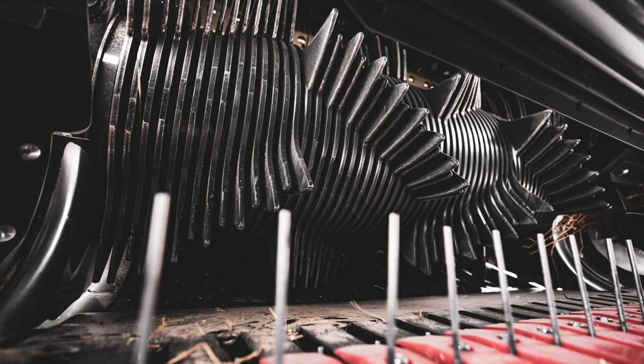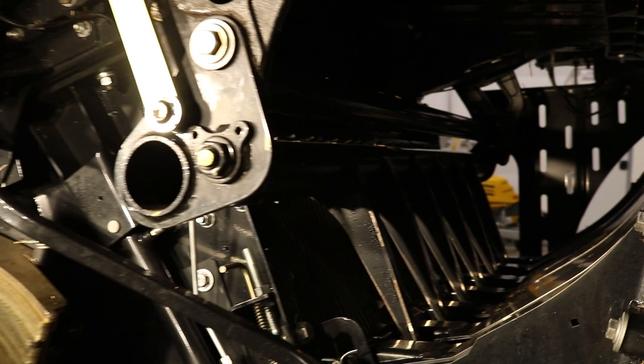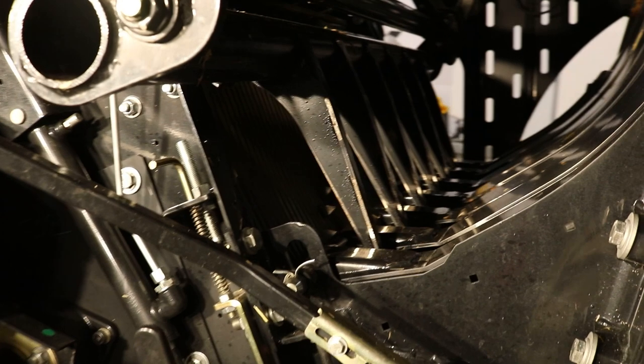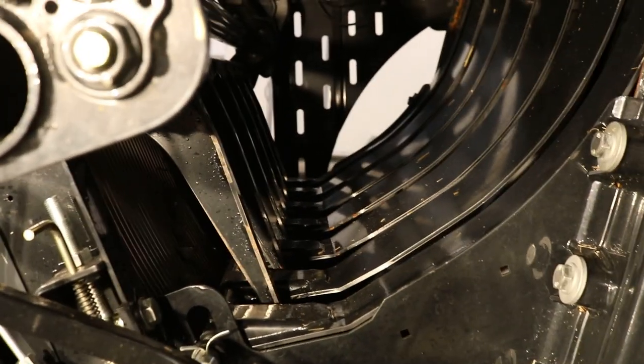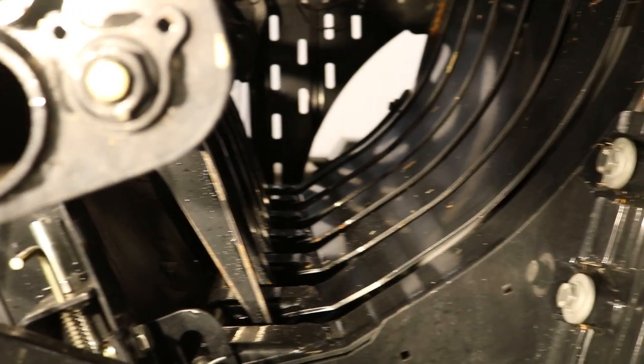There is even a long life feeder available for extra tough conditions such as abrasive crops and abrasive soils. The stuffer pushes or flicks the wad in behind the plunger. With the consistently sized wad, the design achieves an excellent top fill and shape. Maximum output is achieved when the stuffer and plunger strokes match in a one to one ratio.